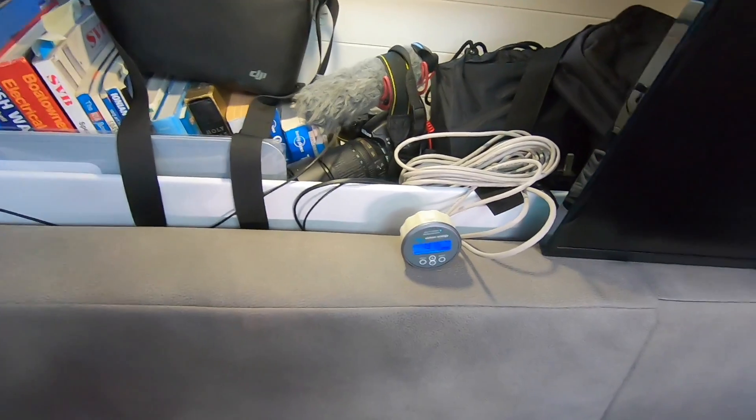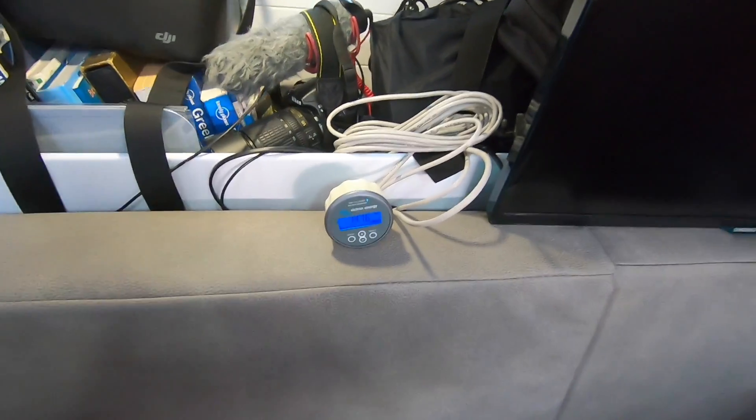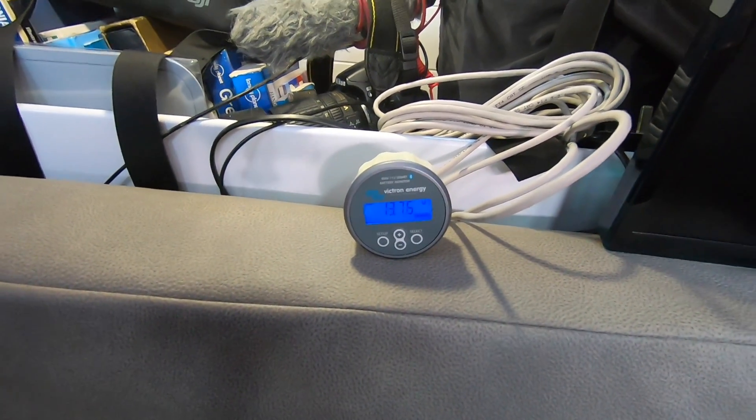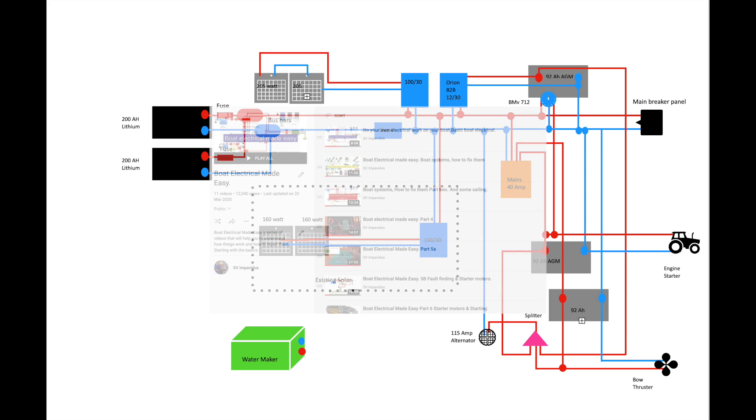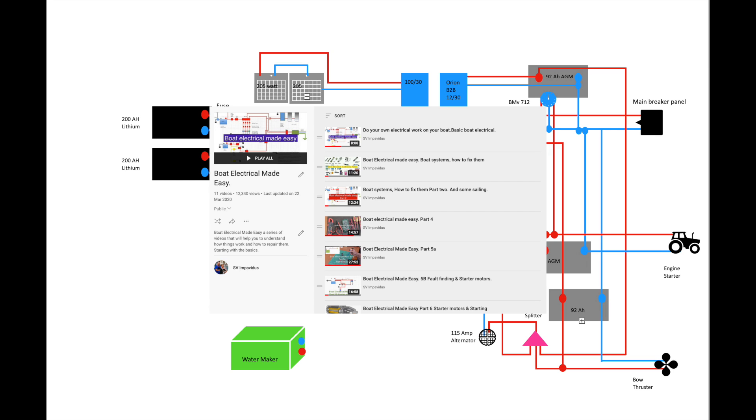That's the solar basically done, apart from the panel work and programming. So far it's working extremely well. Once I've made up the panel and fitted the display in, that will be the solar part of this project completed. It went very well - parts were easy to get here in Turkey and everything was easy to connect. I'd always recommend that you do yourself a schematic drawing like this. It helps you to plan out where the connections have got to be made. It doesn't necessarily show where components are in relation to one another - for example our solar chargers are next to one another, not at the top and bottom of the boat as shown on the schematic. But that's the point - it allows you to plan things out.